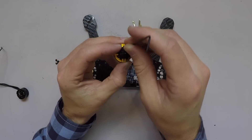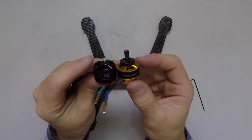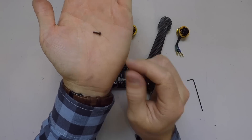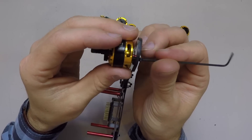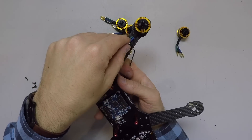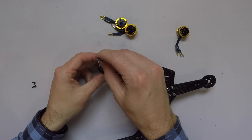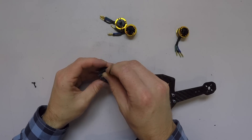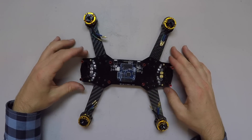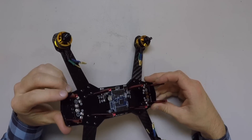We're going to grab our little bolt and start screwing them in — going from looking like this to looking like this. Now you've got something to screw onto the tip of the motor. We've got all four motors and we just need to attach them to the arms, using our longer 7mm screws. The lead wire is facing inward towards the inside. Make sure these screws are relatively tight. Now we've got all four of our motors with all of our lead wires facing inward, so we can connect them to the ESCs and then the ESCs to the Naze32.